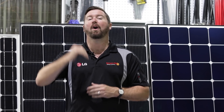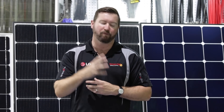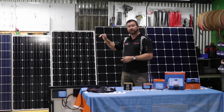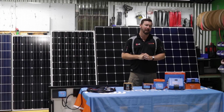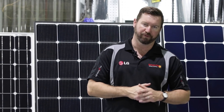Use the Victron calculator and software to determine the voltage input into the regulator. Voltage out of a solar panel is affected by temperature — the colder it is, the higher the voltage output. If you go over the 75-volt input limit on your regulator, you will do irreparable damage to it. So you need to ensure you're designing the input and regulator to suit the maximum voltage at minimum temperature. Also, if you're putting solar panels in series and one is shaded, the other panel in series is affected — you might be better off putting your panels in parallel. Although you won't yield as much from your MPPT, if one panel is shaded, the other will still continue to perform.